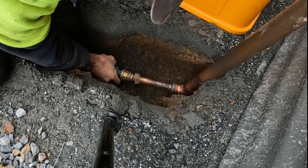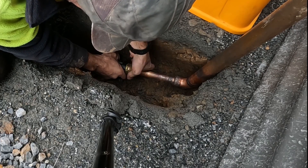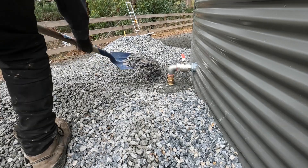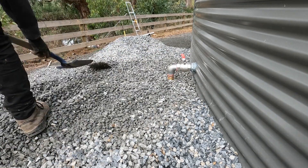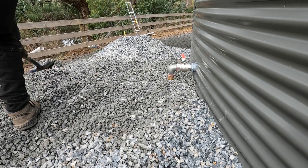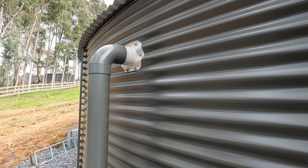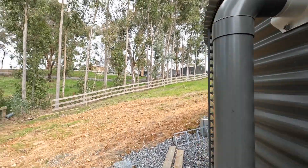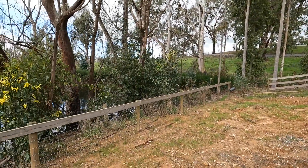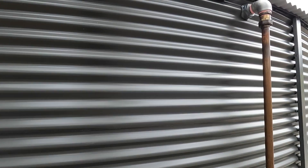There's also a poly pipe — it's a green line because it's a lower pressure line — and this is the transfer to the tank, so all water to this tank will be pumped through a transfer pump, which I'll go through in the next video. Around the entire thing is 20mm gravel just to stop erosion. This is the overflow, which goes into a second dam I have right next to this tank, and this is the incoming water supply.